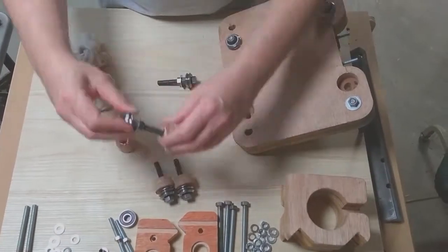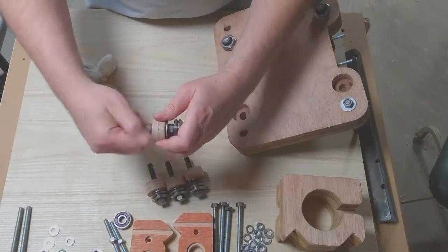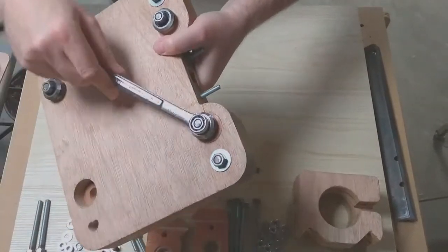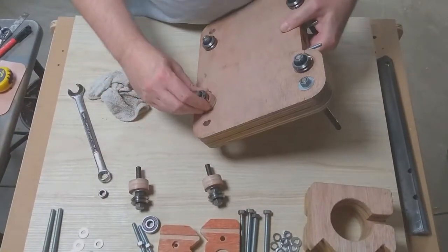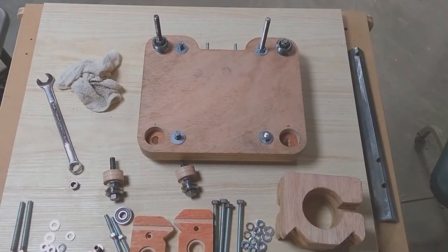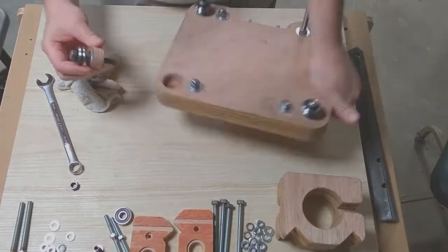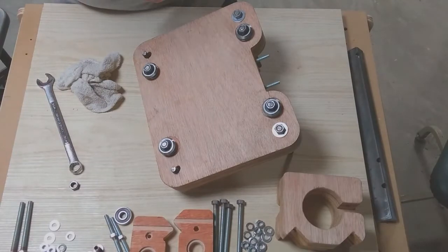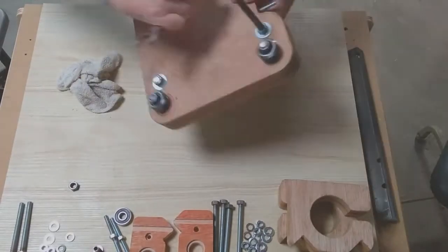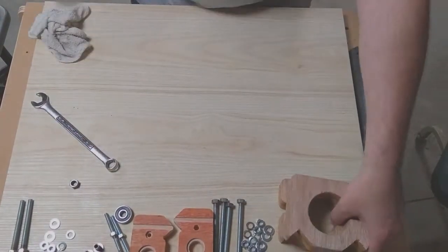Here I'm adding glue into the recesses so there are no air gaps, so they compress up real nice when I tighten them. That one is a little hard to push in so I'm using a nut to push it all the way down. Those wooden round cam pieces — before all this began I made sure they fit correctly and sanded them down, since coming off the CNC they may have been a little too tight. I numbered them for the correct holes and coated the cams with candle wax as a lubricant so they have a nice slide action.